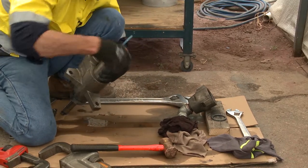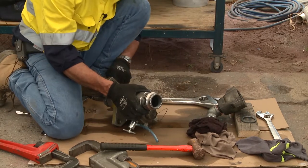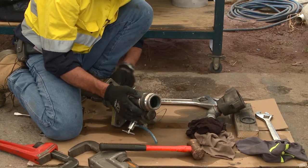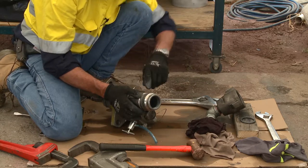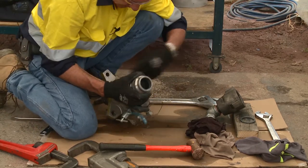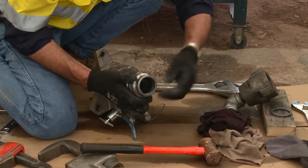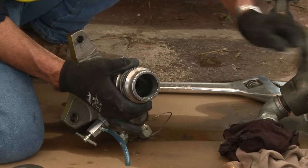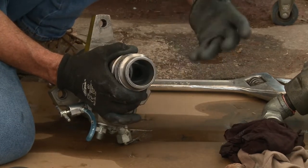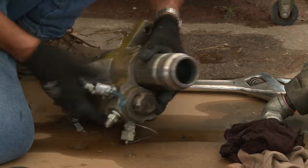This is your cylinder. What you're looking for is any scouring on the cylinder wall. These are static packings and moving packings — the top stack of packings remains in one position while the bottom packings attached to the piston move in and out, causing eventual wear on the cylinder wall. You're looking for scouring in a vertical sequence, caused by contamination carried up through the wall or high-wear products such as vinyl esters, calcium silicates, iron oxides.